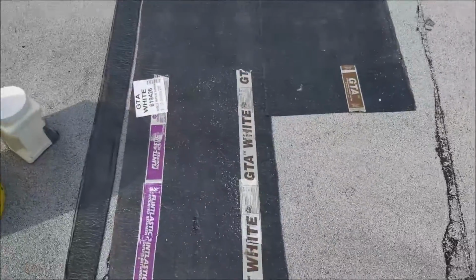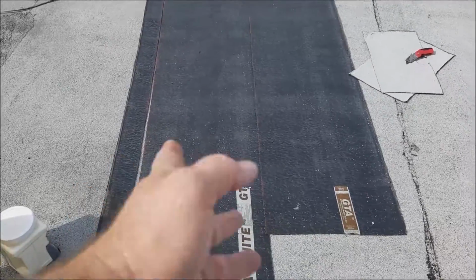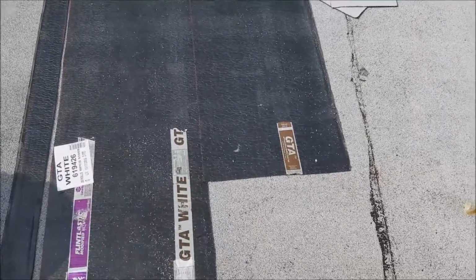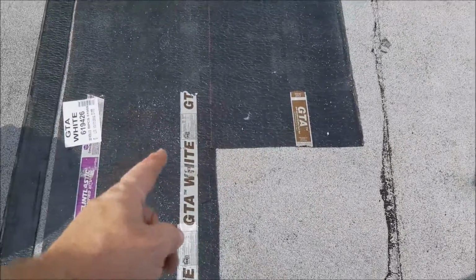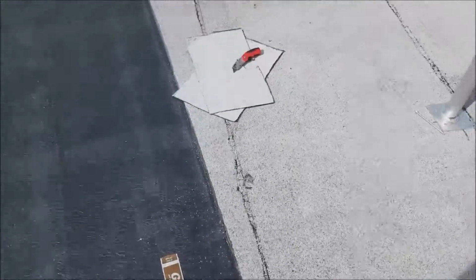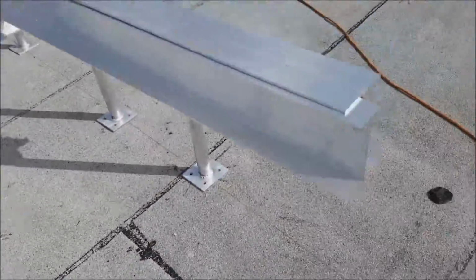Okay, now what I've done is set them up with a pattern. With cutting your salvage edge off, you've got 36 inches, so we're just going to do 18 by 18. But in order to get an 18 by 18, we're doing 18 wide, and you'll do 21 long. That way you can split it in the middle and get a lap, because the pipes are already put together. So obviously we can't slide it down over the pipe.